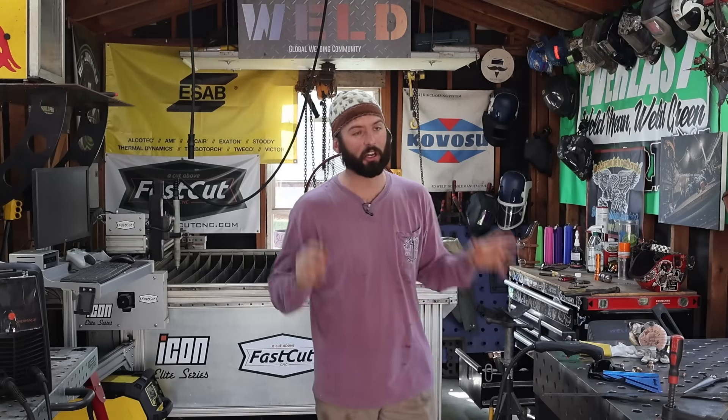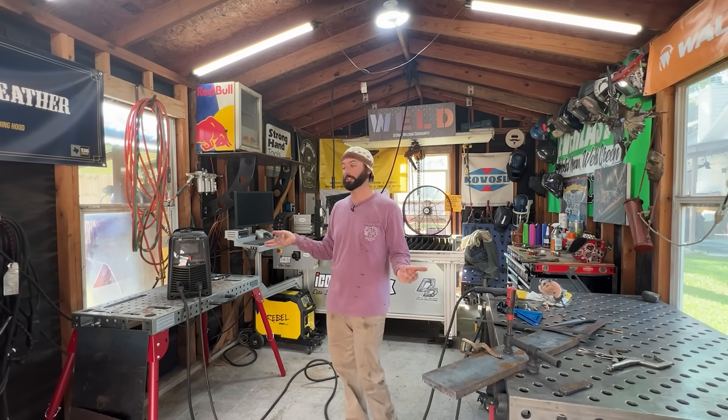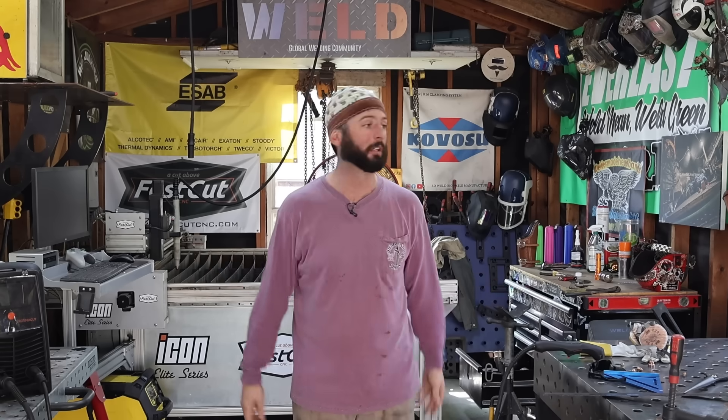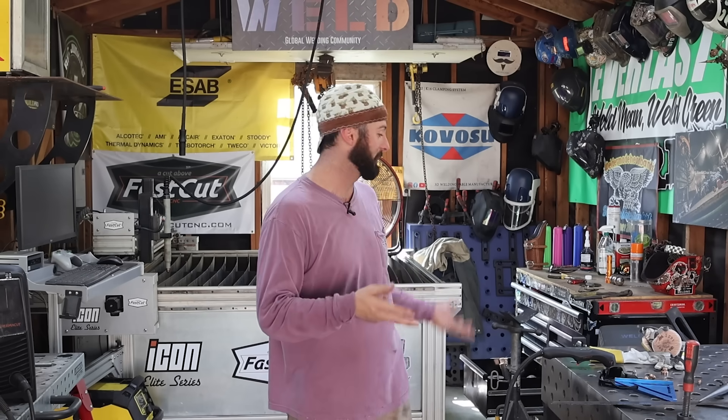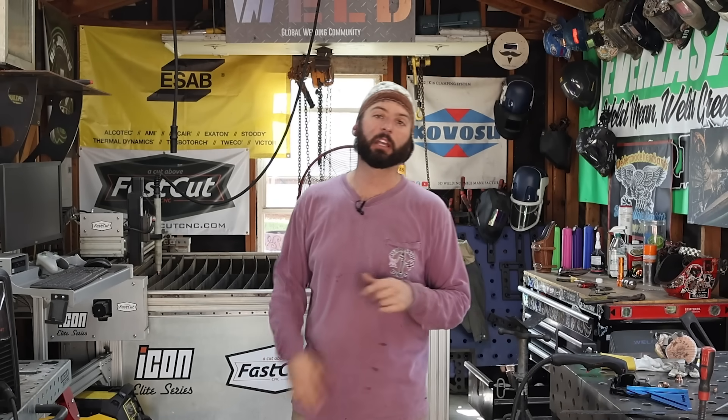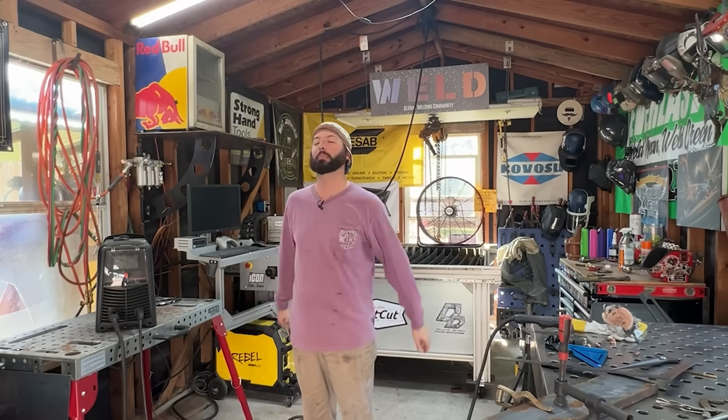If you take anything away from this: I just max out my machines, turn them all the way up, and judge my travel speed from there. I get a little more particular when I get to thicker materials. If you're just plasma cutting sheet metal by hand, cut it hot and fast — all the way up. As you get to thicker metals, fine-tune your amperage and your electrodes. When you get to a CNC table, you really need to pay attention to those things. Thanks for watching, and please check out our partners down below: Thermacut, Abicor Binzel, Caiman Gloves, and PIP — they help us make this content for you.